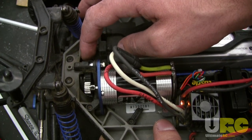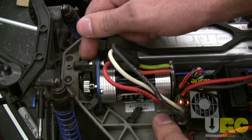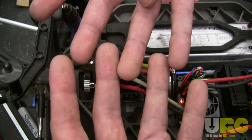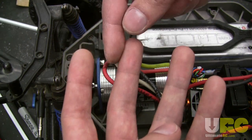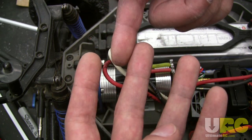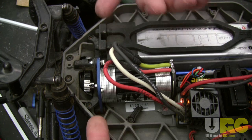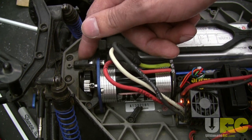This is a small amount of gap, but I've now guaranteed that this is a good mesh. Gears — the individual teeth of the gears — are shaped to mesh together; it's not just randomly teeth going together. These individual edges have a particular shape on them, and when they are meshed at the correct angle and the correct distance, the sound will go down quite a bit. That's an easy way to set your mesh without having to put a piece of paper in there or try to guesstimate it based on how far it's moving.